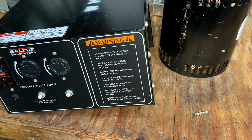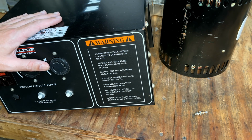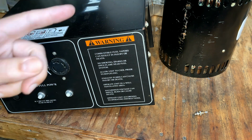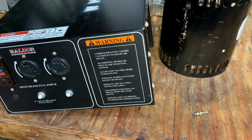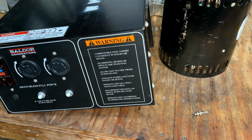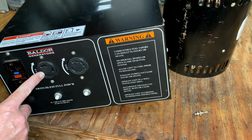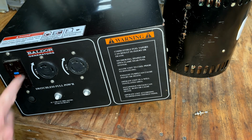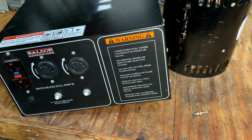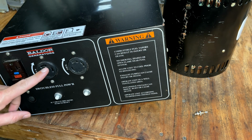We'll put on that other generator head that I showed at the beginning of the video. But it's not quite that easy because this stator has 3 legs in it. And I still wasn't sure why. So I looked at this panel more closely and realized why there's 3 legs. There is a 120 volt outlet here at 40 amps. And each leg on that stator only outputs 20. So definitely 2 of those legs have been paralleled to do this.